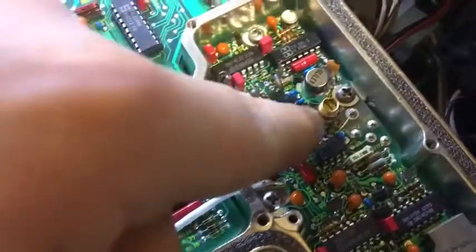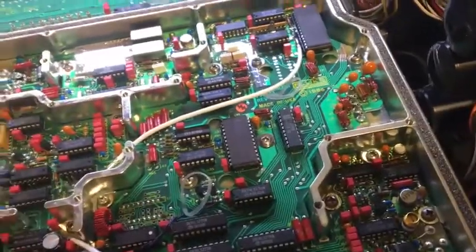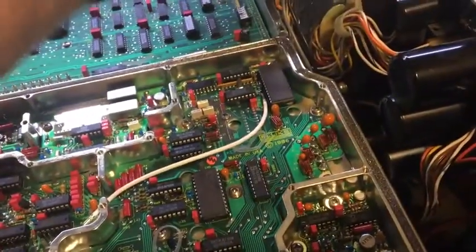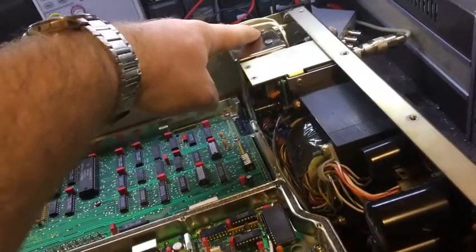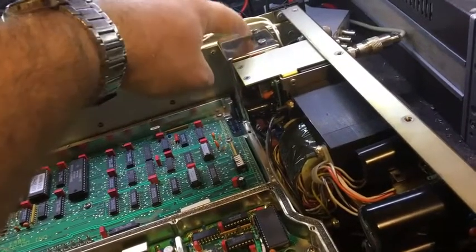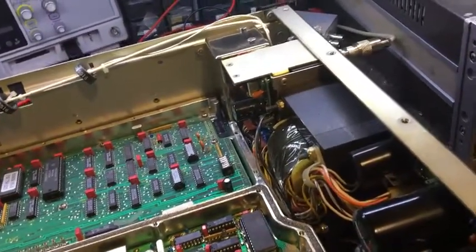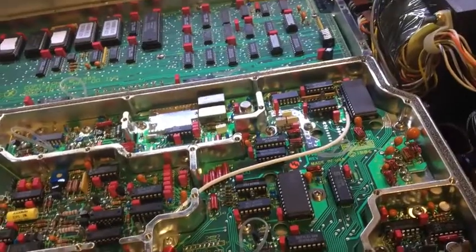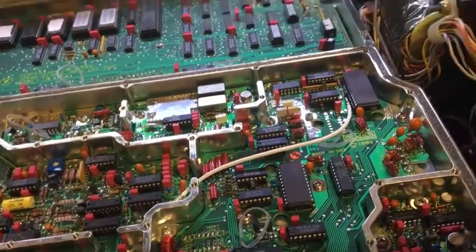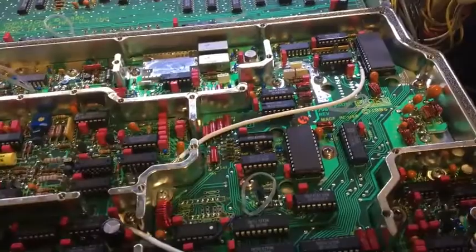I think I'm going to have to go through the calibration procedure and actually check this, because there's a certain way of calibrating it using the reference. And I set this based on the loop on the outside, stuff like that. But now I've got the crystal oscillator working properly, I can actually do that. I've only done the coarse tune, I haven't done the fine tune yet. I set that in the centre before I put it all back together. So the fine tune is adjustable. I might just give it a slight tweak to get that bang on 10 megahertz. My frequency counter I know is bang on, because I calibrate that against the rubidium standard, which I've got here, and so I'm comfortable that's okay. So I'm going to set this to be the same as my frequency counter, and I should be pretty accurate with that.